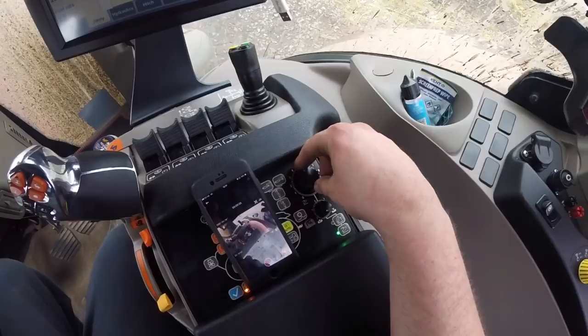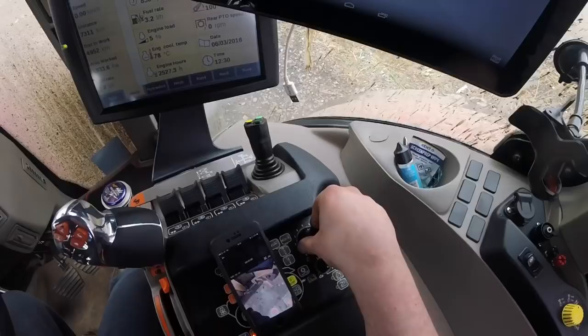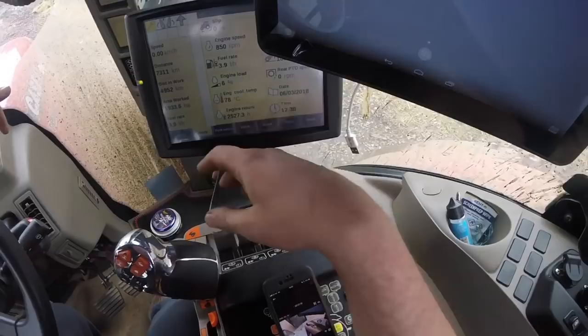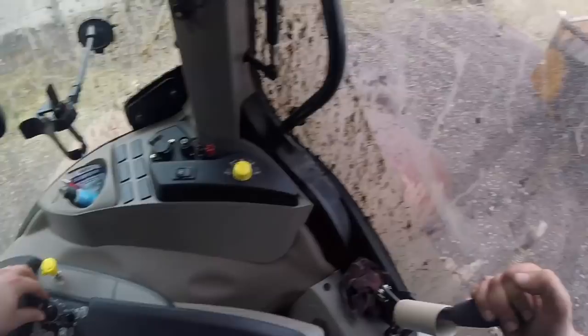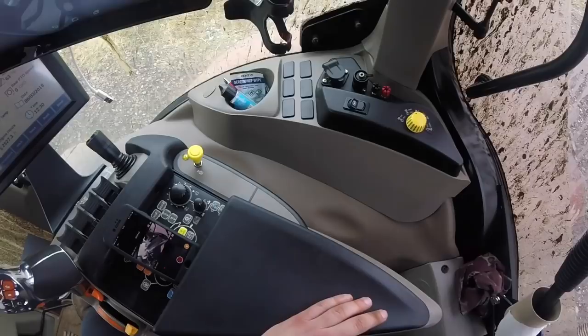So this is your depth control here. You want your arms lifted all the way up, so you turn it as far as it'll go. On a Puma, turn it around to 10, and on the screen that registers 100% — so that's all the way up. I've got my pick-up hitch on number one, so pull that in — I want that retracted all the way in. Because if you push it the other way it'll extend once it's released from the locking mechanism. Pull that back just to make sure it's all the way retracted. Behind me it also doubles up as a really good toilet roll holder. Pull this all the way — that releases the locking mechanism. There's a pin that goes through a slot, and you drop down on your arms — not all the way, you don't need to go all the way — and you can let go, and it'll sort of stay there.